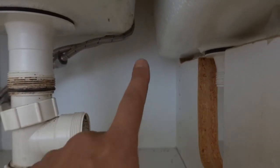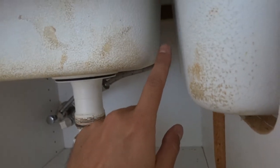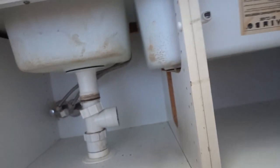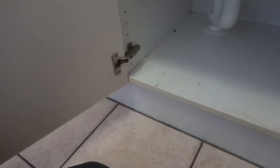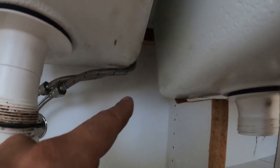What I'm going to do is show you guys the base of the tap, because in order to remove our kitchen tap there's a little nut underneath — usually one or two nuts, just depends. We'll have a quick look underneath and see. You can see there we've got two nuts on top and we need to remove those. It is a little bit tight under here, so one of the best tools to use when you've got limited space — I always carry these in my bag — is a set of tube spanners. They're nice and long and we can get them into tight areas. Before we undo those two little nuts we're going to undo our hose connections here.